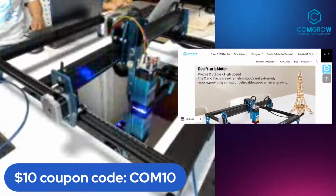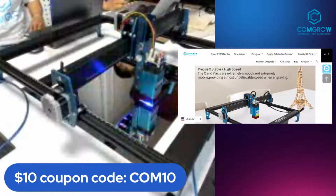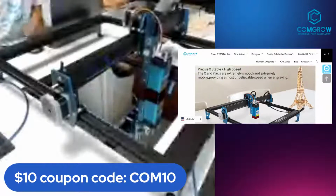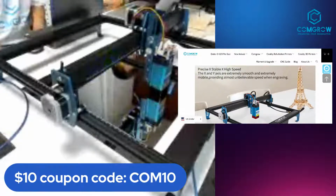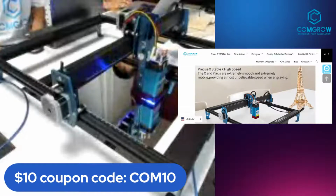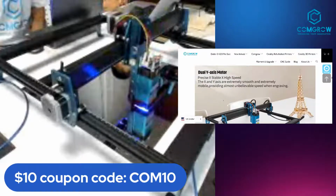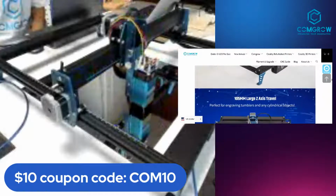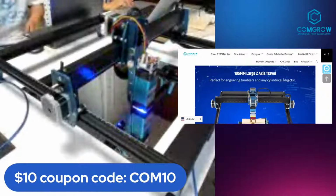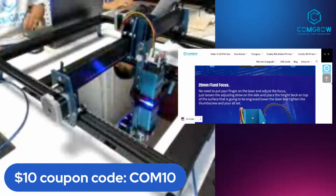So as our engineer Changzhou explained, that is why we use these dual Y-axis motors. We want to achieve precise, stable, and high-speed motion, so the X and Y axes are extremely smooth and mobile, providing almost unbelievable speed when engraving. This is also the base structure that supports us being capable of 5,000 millimeters per minute. On the market now, I think most laser engravers in this price range or with this specification do not have dual Y-axis motors. This is a big difference between this model and the others. With only one motor, the speed cannot be almost the same as 5,000.